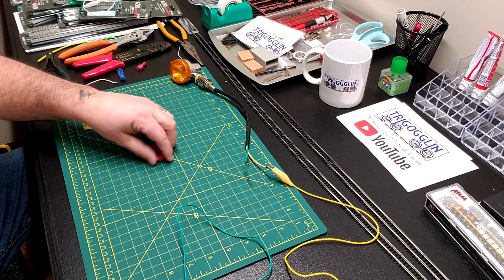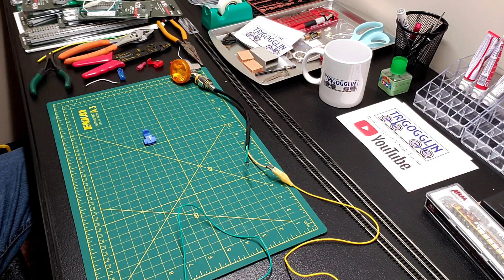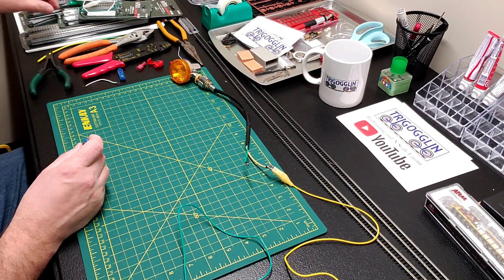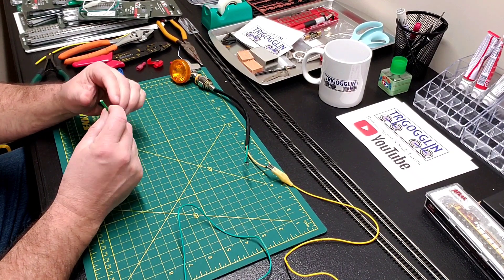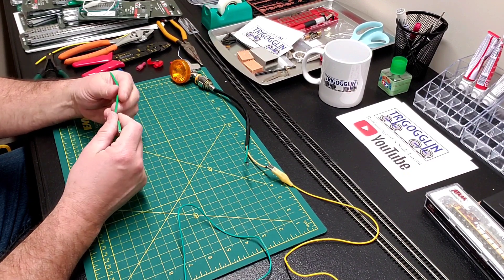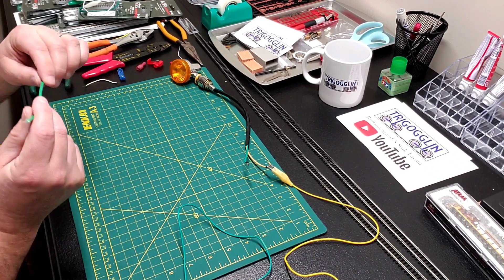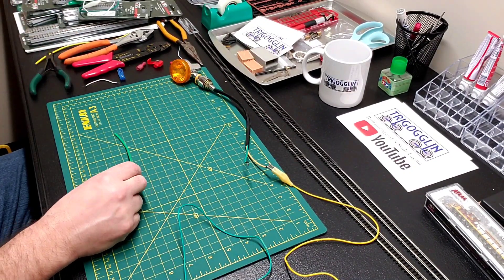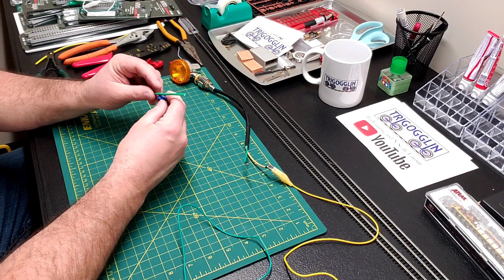Most people know the bigger the number the smaller the wire. My layout is basically going to use 14 gauge because it's not that big. The problem I have with these: my 14 gauge wire is stranded, not solid wire. I'm using the blue and white one but I already had two spools in my garage — solid is probably better for a connection but stranded will be okay.